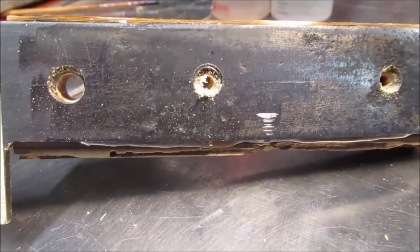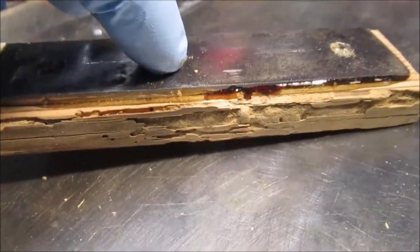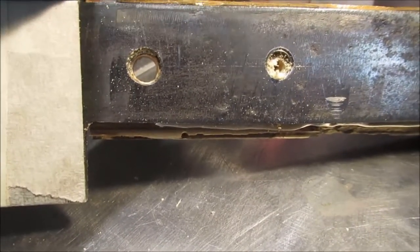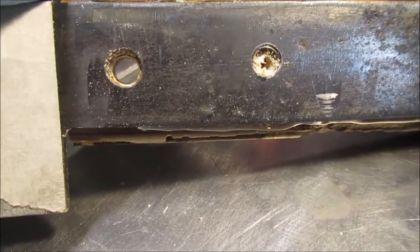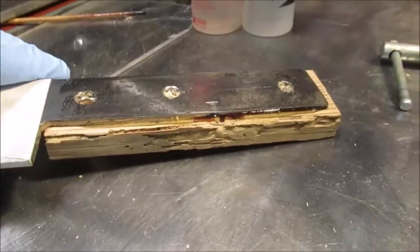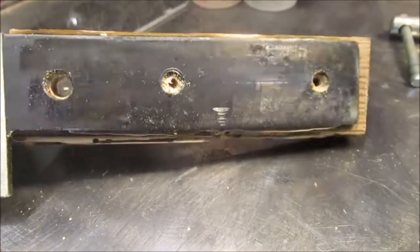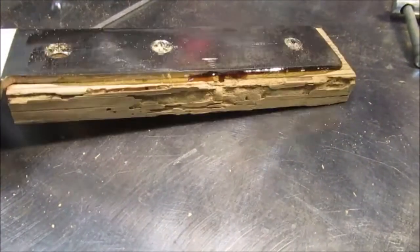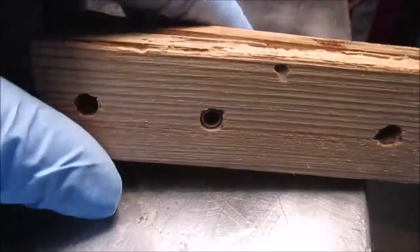I think we'll glue the other side and drill a sixteenth of an inch hole going through. I just wanted to show you - on the quarter inch we might drill almost all the way through and then go real slow. We're just using a cordless drill - don't use anything powerful when gluing this side on. It's probably been about 30 minutes. When this is done it'll set overnight before I do any sanding - I want it to cure for 24 hours.